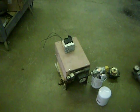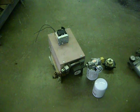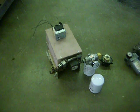Never go up against the ceiling and run downhill. That will not bleed the air out. Be sure to check all your local and national codes, which may vary from this, before you hook your furnace up.